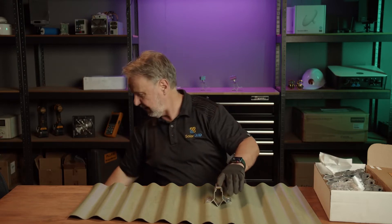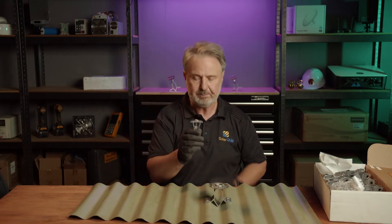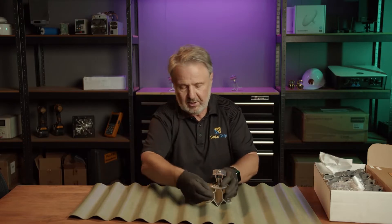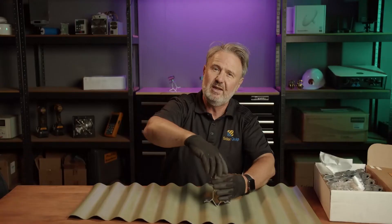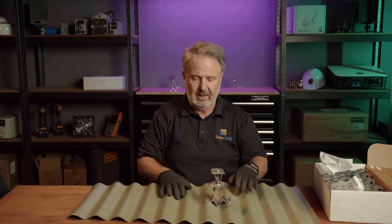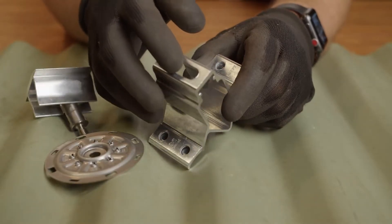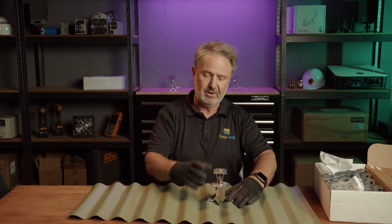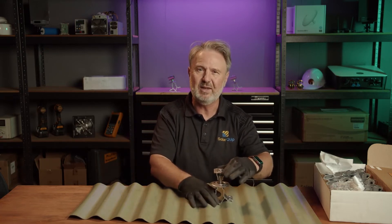The other nice feature is how you bond the panel to earth. What we've got here is a mid clamp, and the mid clamp goes on like this. There's a small nut which slides into a slot so it can't fall out — we slide the nut in like this. And we can do all this on the ground, by the way. You don't have to be up on the roof doing this. So the idea is you prep all of your mid and end clamps ready to mount the system. There's a slot in the top which gives you quite a bit of movement to adjust the position after you've screwed it down. When you first apply the panel, put the clamp in the middle — if you need to tweak it, you've got a little movement there for fine tuning.